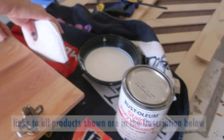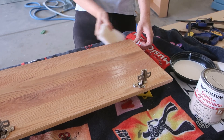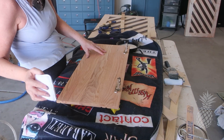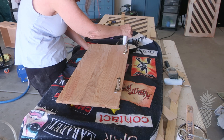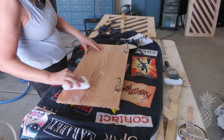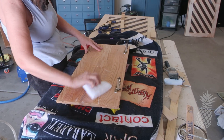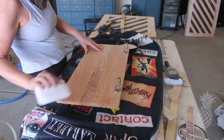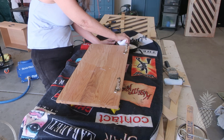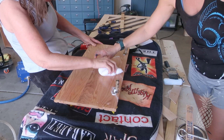On these raw doors and drawers, we asked Instagram what you guys thought we should do. We were thinking a white paint wash, but we also tested out this antique white stain, which really wasn't very white at all — it kept the wood looking very raw and natural, which our Instagram followers loved. So that's what we're using: Rust-Oleum antique white stain and poly. We only did one coat and it's totally sealed. It came out pretty matte and raw — kind of exactly the look we were going for.